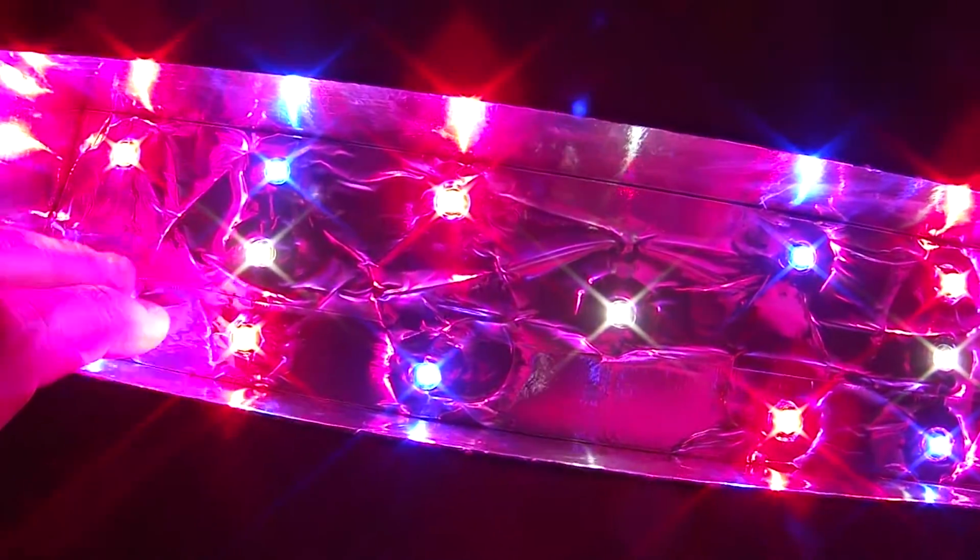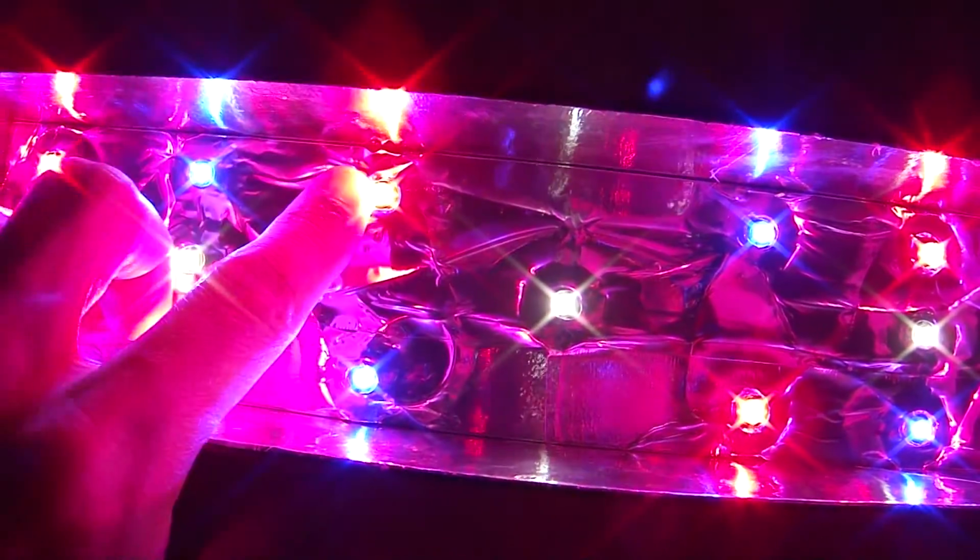And then for dollar, if you have a power surge on an LED array, or if one LED goes out, you have an entire series of LEDs going out. Unless they drive every LED individually, and that is, to be honest, super expensive, because each LED would have to be individually driven, so it would require its own circuit on the circuit board to do that. So when one fails from a power surge, or just because the LED decided to die, you're out an entire part of your array, and then within that, getting it fixed, you're going to have to send it off to somebody. As far as electricity efficiency, they're very efficient, but you have to think of long-term cost. If you get a little bit of dust on one LED, or one starts dimming, it's the entire array's SOL.